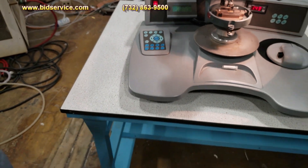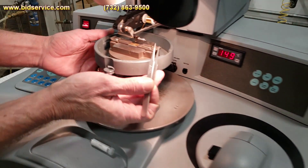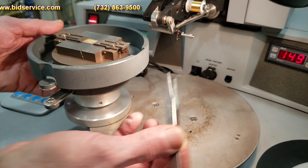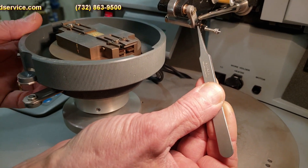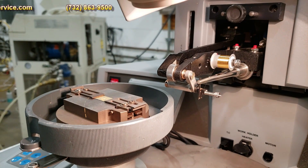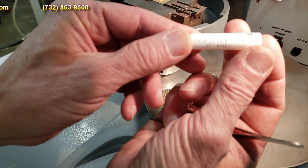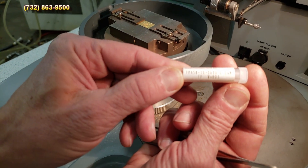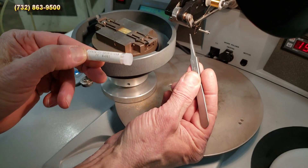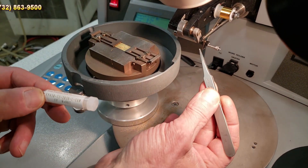The other thing I want to point out is it has a standard access clamp. Let's move the work stage out of the way. The clamp is directly behind the tool. The tool being used here is from Small Precision Tools, and that's the part number we're using. This is a 0.828 length tool — you can use either 0.750 or 0.828.